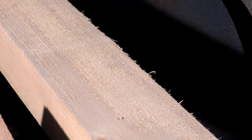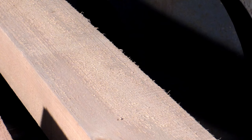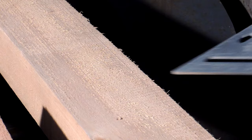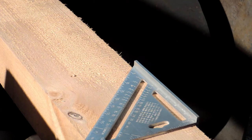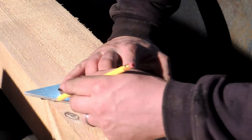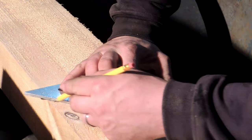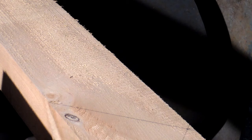Make sure you're laying these out — if you have any of the fuzzies from your sawmill on the corners of your boards, get them off of there. I seem to get it a lot when I'm getting into sapwood. That speed square has got to sit up there nice and square, nice and tight to what you're working with. We're going to lay this out on the opposite end. I'll measure up my 3/8 of an inch, then the line this way and the line that way.